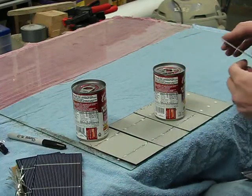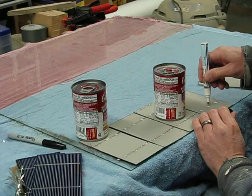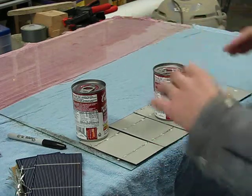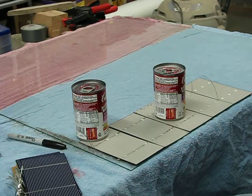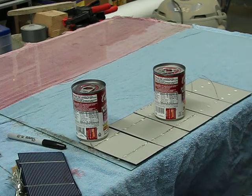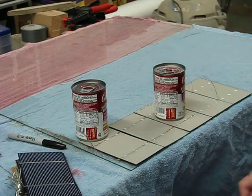For this panel, you've got to figure out the size of yours. This one has four rows of nine — so nine cells in each row. I won't record all of this, but you keep going, finish the row, slide it down, and do the next one. I actually flip it around so the next row starts on the opposite end, because it's easier. When tying rows together, the front side is negative and the back is positive. You run a bus wire and tie the rows together, going either negative to positive or positive to negative. In this case we're going positive to negative.